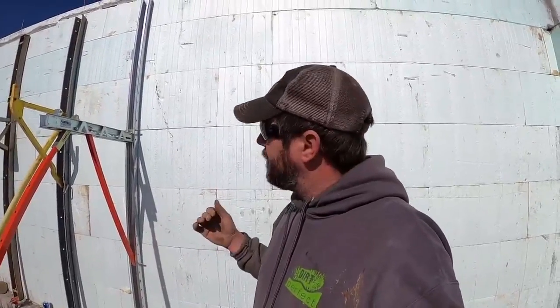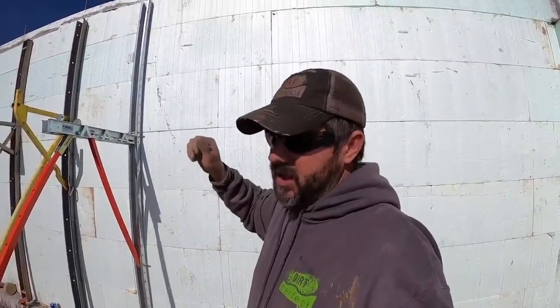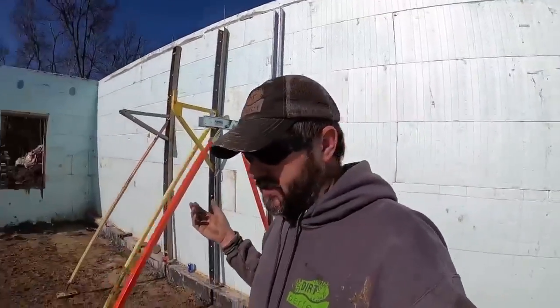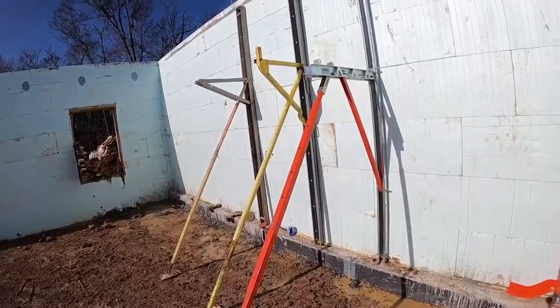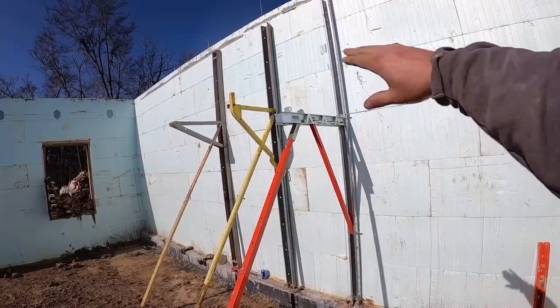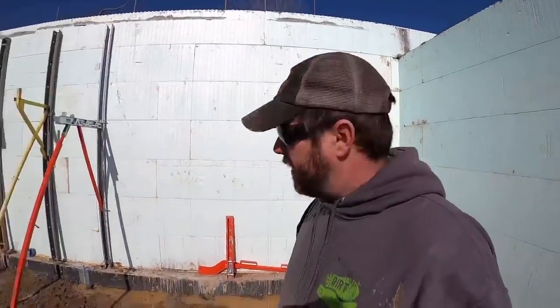On stacking day, I wouldn't say it's a nuisance, but I don't find it quite to be the advantage, because sometimes when you're stacking, you just want to manipulate a brace just a little bit, and you're up there with a pair of pliers doing it because you don't have the tool down here. Not a huge deal. It's just something else you've got to keep around on pour day versus just reaching on one of those and turning them. But like I said, on pour day, I wouldn't have it any other way. That system works awesome. I've got several videos on the channel of doing that.